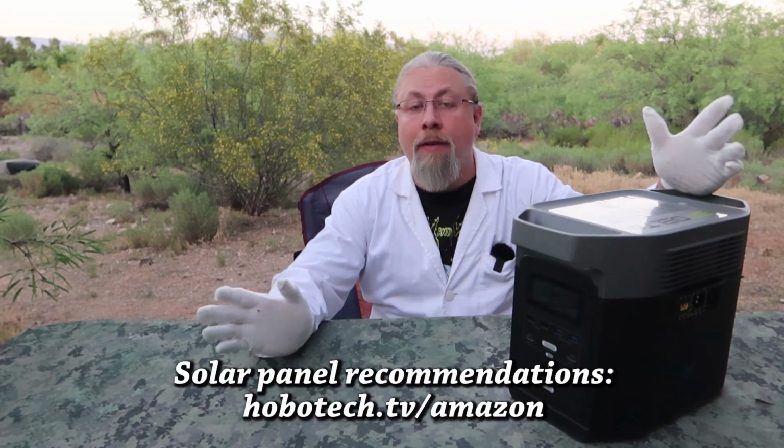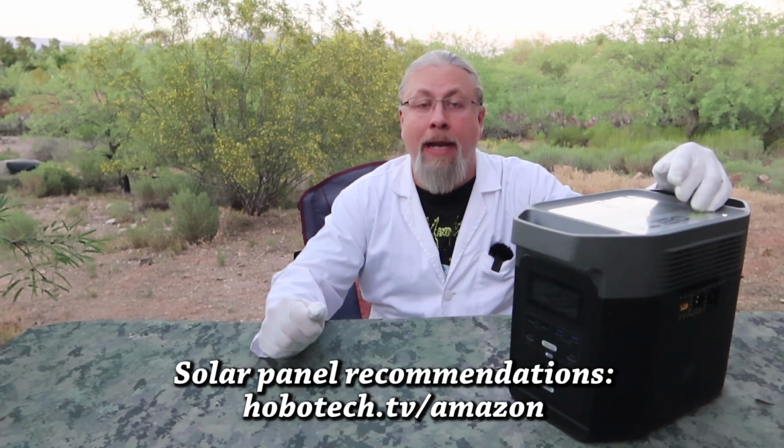Now, what about recommended solar? You can run up to 3 12-volt solar panels in series for the EcoFlow Delta and charge it up to 400 watts. You can put whatever big panels you want. They can be as large as you want as long as they don't exceed, in combined series, 65 volts. I do recommend the 170 watt Bouge RV rigid glass panels that I did review earlier, or you can get a couple of those Windy Nation 100 watt flex panels, or just about anything on hobotech.tv/Amazon. If you want something that folds up, you can't go wrong with any of the folding panels on that page.